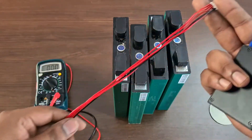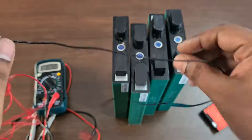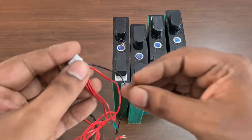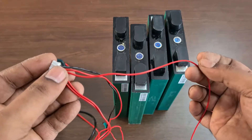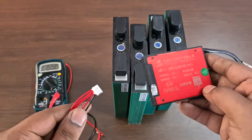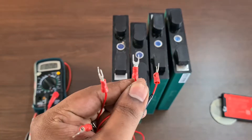The balance cable needs to be connected carefully. You need to send a wire to the correct terminal on each side. The negative side of the battery connects to BMS negative. The first red wire is the second wire — that is the positive of the first cell. The remaining wires connect to the positive terminals going across to the other side of the battery. We use crimped connectors so the battery connections are easier and more secure.